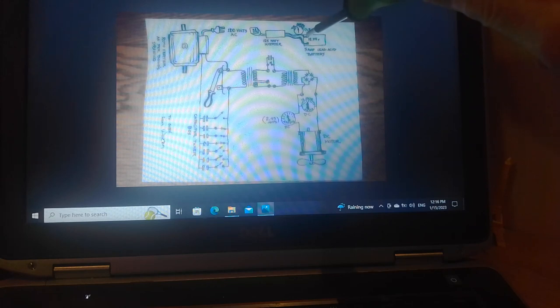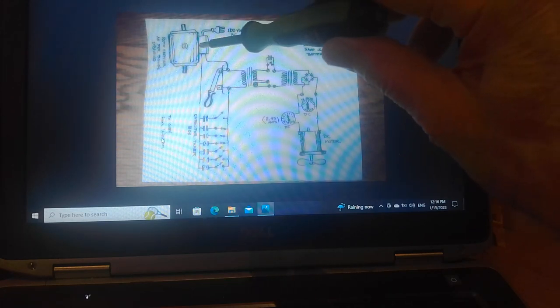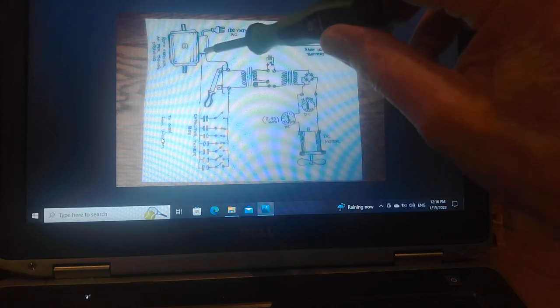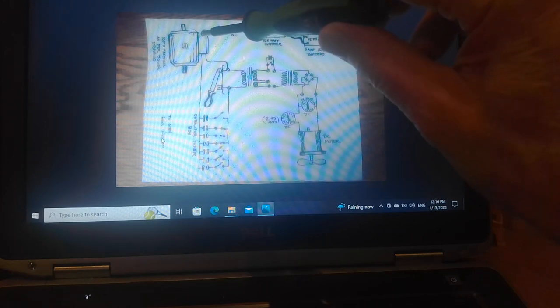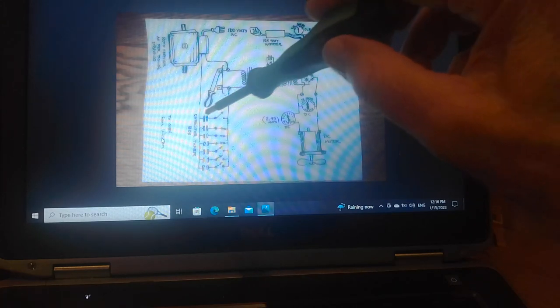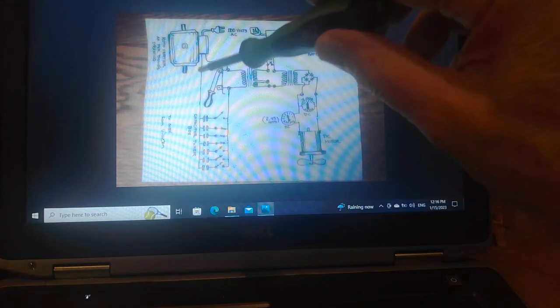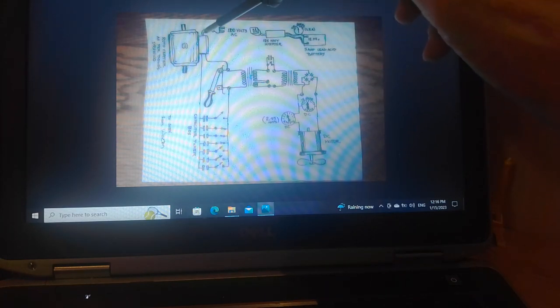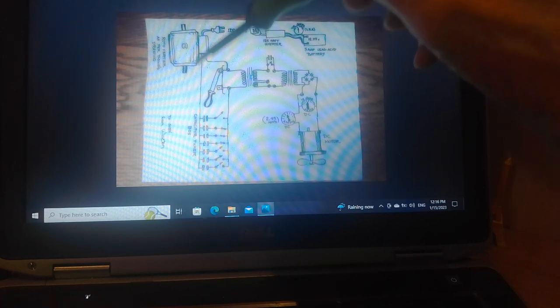12.75 times 1.5 amps into the inverter. The inverter powers this. Notice he has two wires, so one's L1, L2. He has two wires coming out because L2 is common. They connect because the cap, the run cap, goes between L2 and L3. It's a three-phase AC motor, so you have three lines to play with.